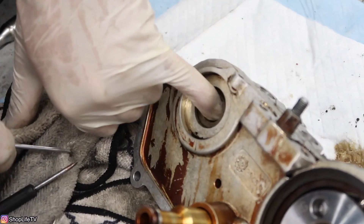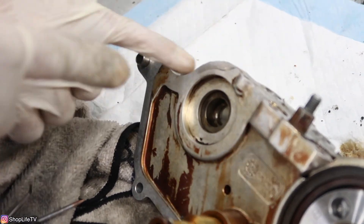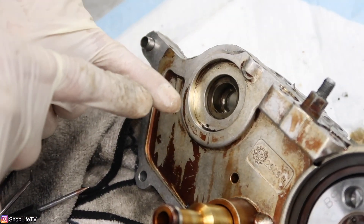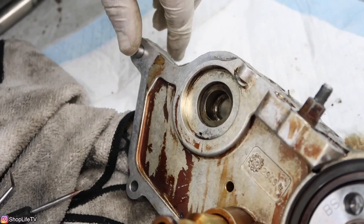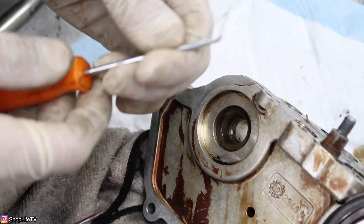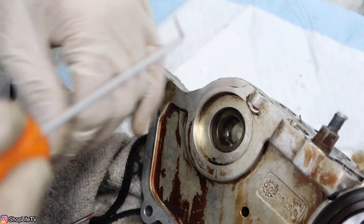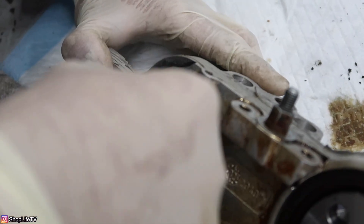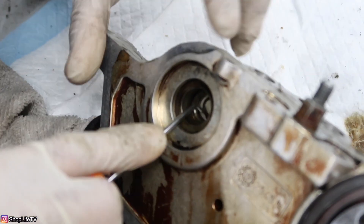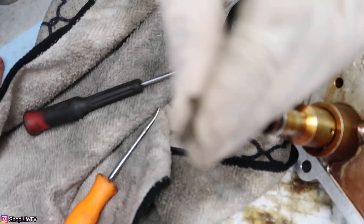There's a seal on the inside of the cylinder, similar to how the piston had a seal, but this one's a little bit opposite. The Teflon seal is still on the outside and there's another o-ring on the inside, but as you can see there's a hole so it sits in a different way. You're going to need a 90-degree pick — cut a little hole into that Teflon seal and then pull it out. Cut a little cross section into it, pull it out, and do the same thing to the o-ring on the inside.